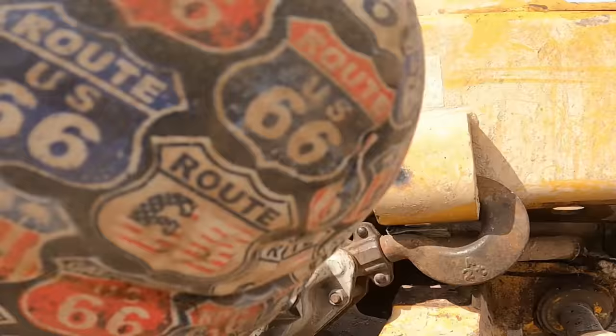Alright guys, well, looks like I got done. Got those little, I don't know, fish plates, gusset plates, I don't know what you call them. Got them on there. Ran the welds past about an inch or so to keep the stresses from building up along that edge there. But that's about as good as I can get it. Let me turn the light on for you guys.